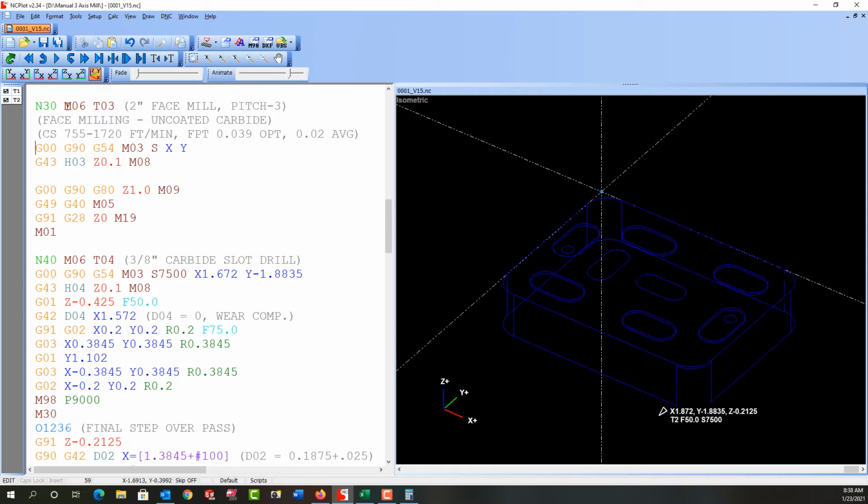So to do that, I've got the code here that we've always used. Put the tool in the spindle, position and turn it on. So we're going to calculate these positions and pick up the height offset. And then we can make our single pass.